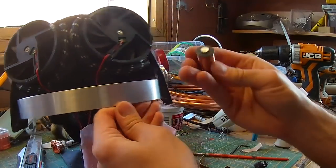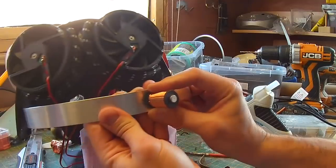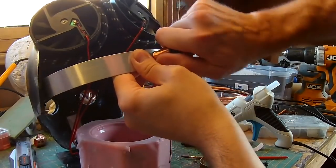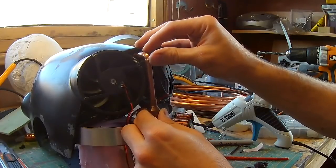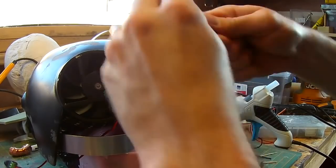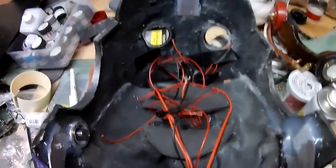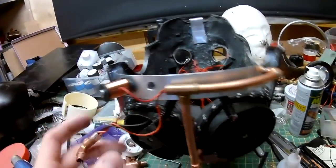Turning my attention to the back of the mask, I've installed a piece of aluminium around the back which creates a bar to connect some components to. I've got these coils from coil-driven tattoo machines - they look quite steampunky and retro - and I'm going to attach those using the handy allen screw on the back. I also want some pipework to feed out the electronic cables that will attach to the NeoPixel rings in the eyes. I'm going to thread the wires through copper piping, which then attaches to the Arduino at the back. It was a little fiddly to get the wires through all the twists and turns, but it's a bit of a mess of wires inside the helmet at the minute - that'll be tidier once I've installed the NeoPixel rings.